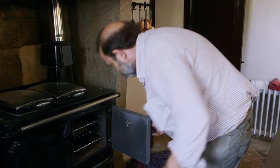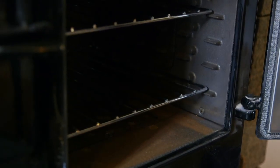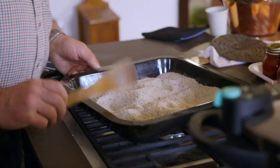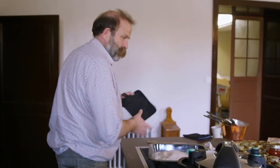In the kitchen, Dick is slaving over a hot stove — but he isn't making pain au chocolat. He's baking sand. It's an ingenious trick for the balustrade outside: drying the sand to add to the epoxy mix so it matches the colour of the stone, rather than the white of the plain mix, and gives the mortar the texture of stone. That was Steve's idea, so Dick is just going along with it. He leaves it in the warm kitchen until it's needed.